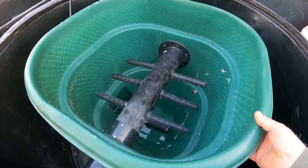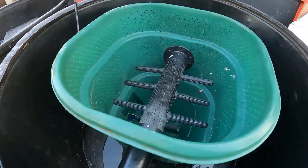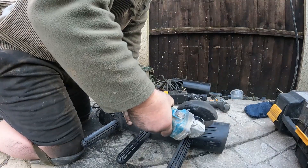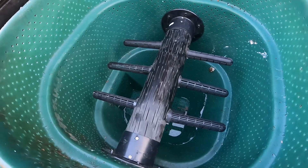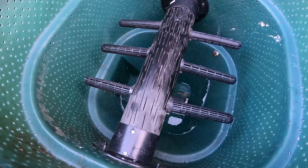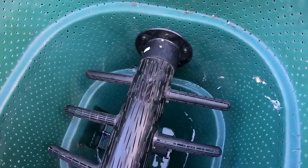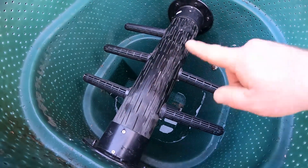The mechanical filter is now fixed in place, and quite pleased with how that's turned out. We perforated hundreds of holes in that using the angle grinder and fastened these inlet strainers — pump inlet strainers. That should let the water through but keep the K1 media contained in here.